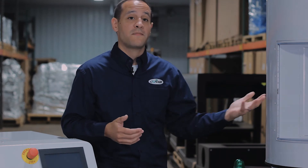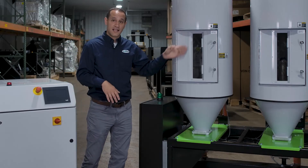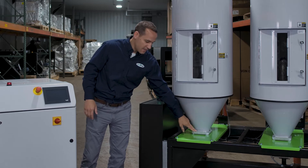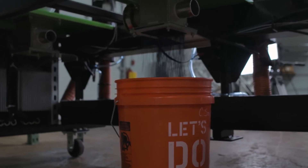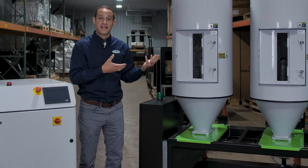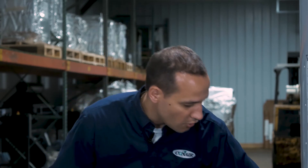This particular cart has three 50-pound-per-hour hoppers. Each hopper comes standard with a full-level sight glass in the door and a slide gate for shutting the material flow on and off. Internal to the hopper, just like on our DX style dryers, there's a diffuser cone with a drop tube so you make sure that all your materials dry down into the cone section, so your first shot of material is ready to go.